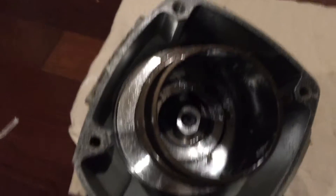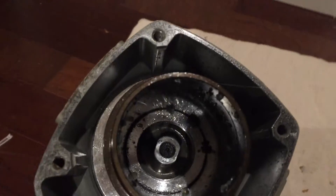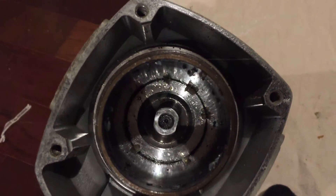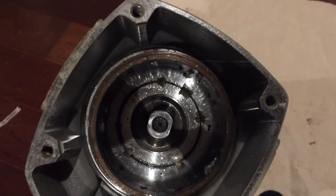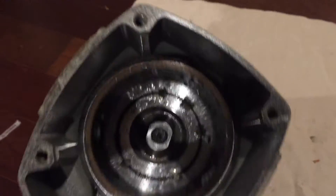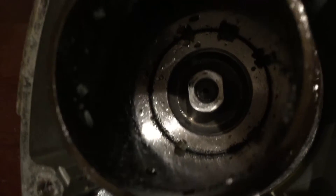So if you look in the gun, you'll see all kinds of debris in there. This is the shaft — the piston shaft — that cylinder shaft where the piston goes up and down. That has to be super clean; there can't be any debris. See all the plastic on the walls there — you can actually see some more plastic on the walls. Very minute particles — that all has to be cleaned out.